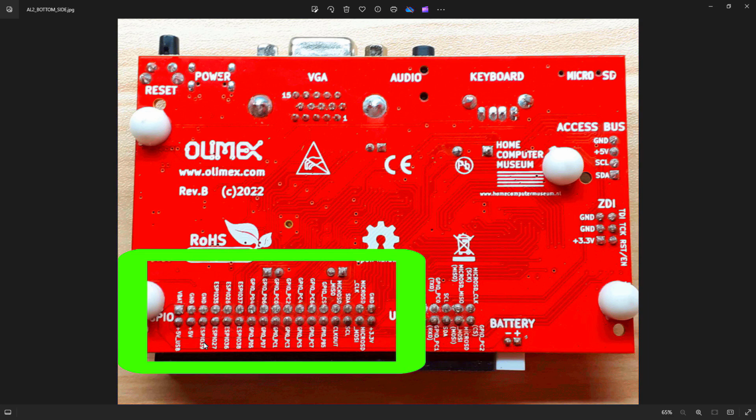The next one is going to be GPIO. The GPIO has got a whole bunch of general purpose pins running over, I think, 3 ports. It's B, C and D, I think, but one of them is only one pin from one port. You've got ground, 3.3 volts, and then 5 volts over there. The power provided here has got suppression protection diodes, which is handy to protect it from surges. There's also a couple of micro SD interface pins here. I don't know how they interact with the ones that we're already using elsewhere for the micro SD. We'll have to have a look at that.